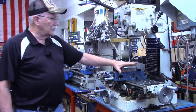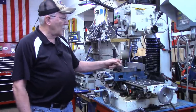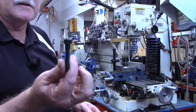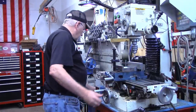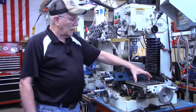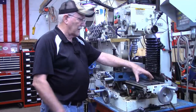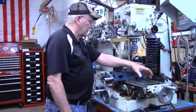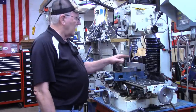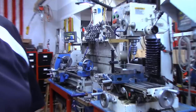What we want to do is find the center of this piece on both the X and Y axis, then drill and counter bore some holes for the 3/8 by 16 socket head cap screws, which is what the T-nuts in my mill use. The spacing on the slots in my mill table is 4.969 inches, which I suspect is 125 millimeters or pretty close. We'll take half of that from center and go half that distance each side of center.